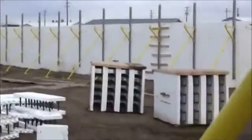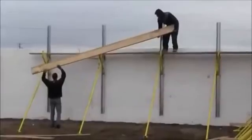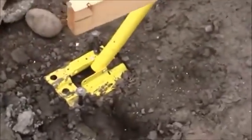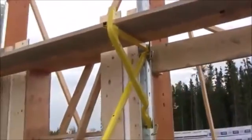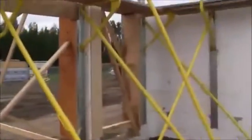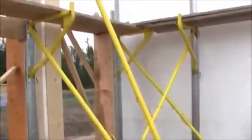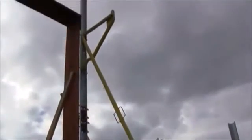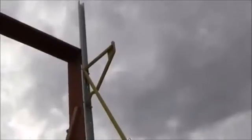If I come inside here, you can see they're setting it up. We have the ten-foot scaffold and they're now putting the planks on top of it. What it consists of is a foot that looks like this. We have a couple of pegs and we're going to put two more in yet. The scaffold bracket clicks on like this, and once we're done we're going to go up with two poles on the outside. This allows us to go up to 20 foot high. We're only going 18, so we'll have those sticking up over the top a little bit.